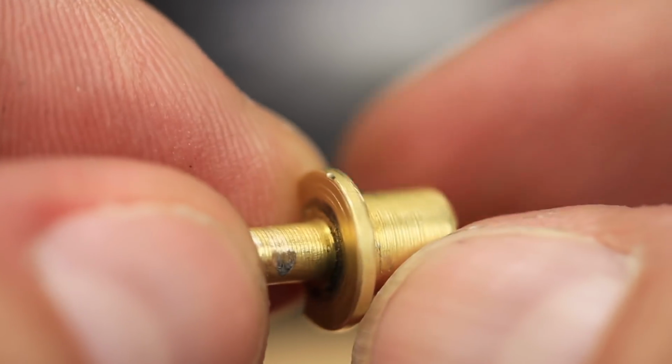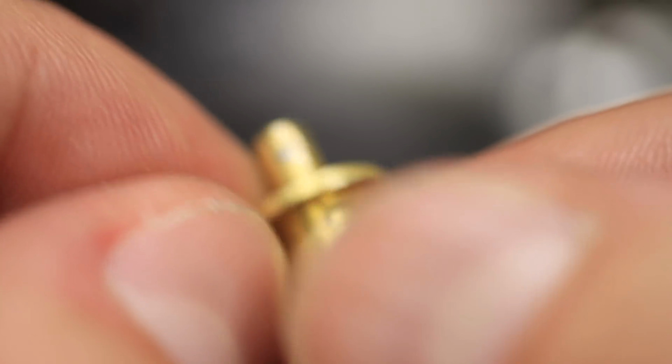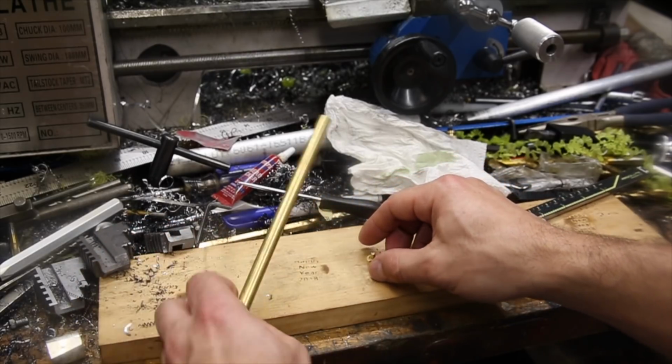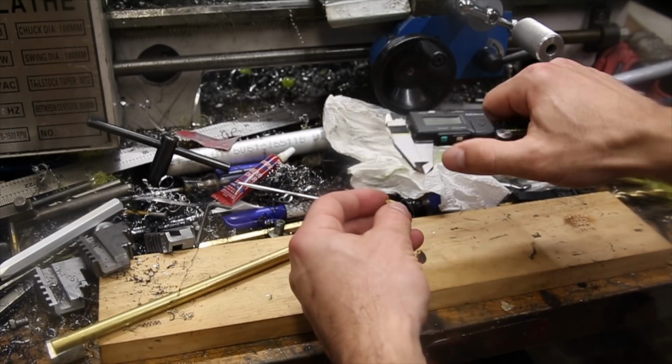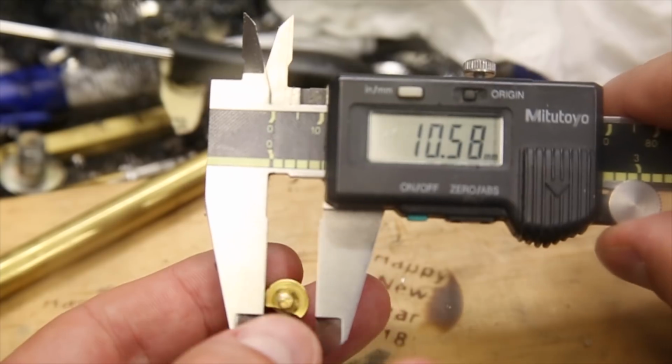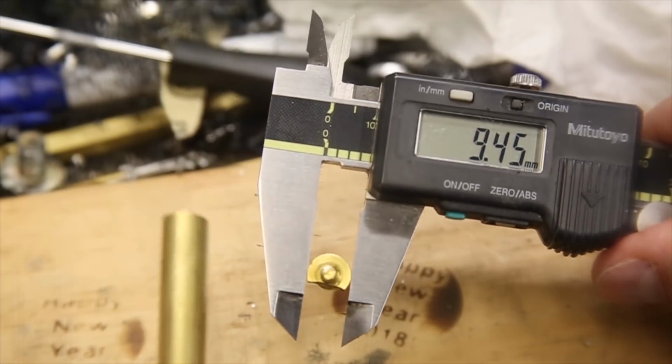I'm not sure if this is a cast piece or not, but maybe someone with a more experienced eye can leave a comment below. Either way, I'm going to be making a new one. I'll be using this piece of 3/8 inch diameter brass round stock. The extra convenience with this size is that it is nearly the same outside diameter as the diameter of the flange of the piece I'm remaking.